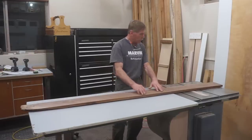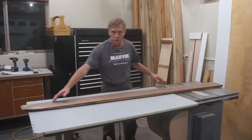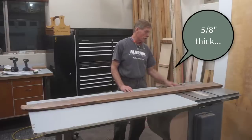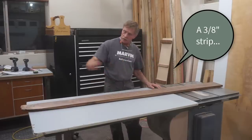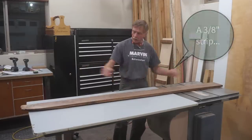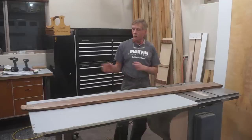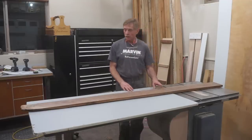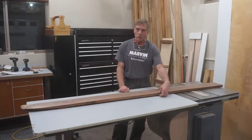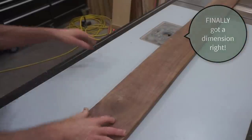For instance, if I went to take this full 1/4 inch bow out, all of a sudden the ends of this board would be 3/4 inch. By the time I got 1/4 inch twist out of it, I'd be lucky to get 1/4 inch strip out of this whole piece if I tried to flatten it all at once. So by quartering it and getting the pieces down to near their width and length before flattening and thicknessing it, I've got a lot better chances of ending up with nice 3/4 inch pieces from this board that's 7/8 inch thick. You can see the twist